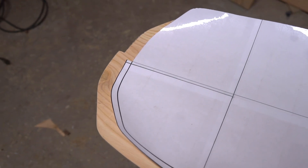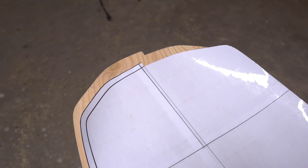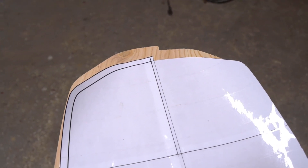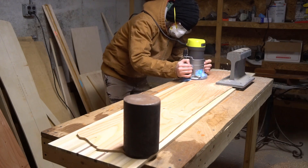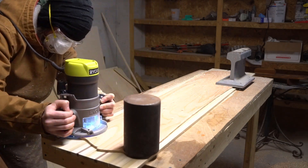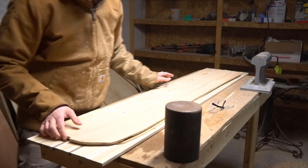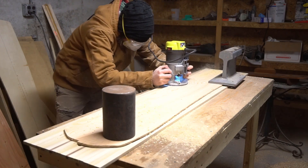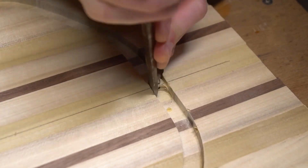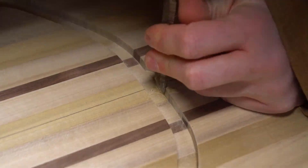Something I really didn't like about the process so far is how many router templates you need just to shape your base and sidewalls — it seemed like for every potential shape you'd want to make, you'd need a lot of plywood just lying around. So I came up with this: it's a single template where you can use one side to route your base sheet and the other side to route your sidewall channels. In both cases, you keep it aligned with your centerline, route one half, flip the template over, and do the other half. For the sidewalls you're left with a little bridge between the two sides.